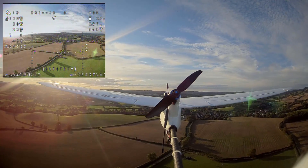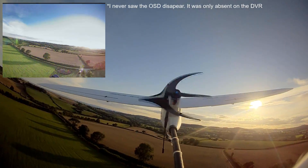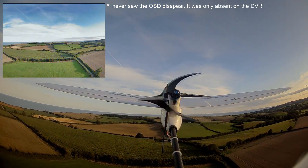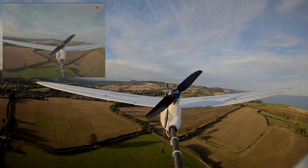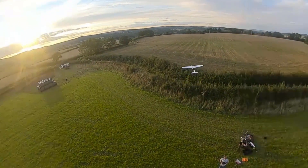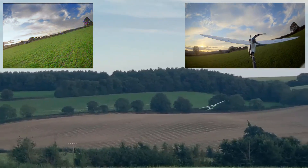The only real issue I encountered was a problem with the OSD. Certain features such as altitude and voltage would occasionally disappear and reappear throughout the flight, although oddly this wasn't recorded by my DVR. Instead, the DVR shows the entire OSD disappearing, which is even more strange. My best guess is that this is something to do with a PAL/NTSC difference between the two FPV cameras. Other than that, everything worked perfectly and the aircraft flew great. I found myself mostly flying through the tail camera feed, which despite having inferior quality to the nose camera, just provided an awesome perspective and was a lot of fun. In total, this maiden flight lasted just over 30 minutes, which I think is pretty good considering I wasn't exactly being restrained with the throttle. On a good day with lots of gliding and maybe some thermals, I reckon that flight time could be doubled, if not more.